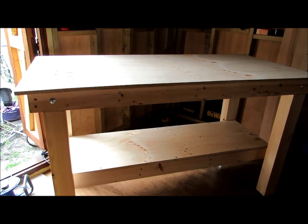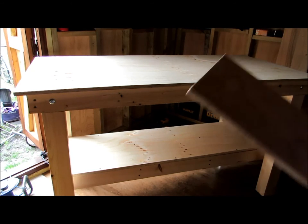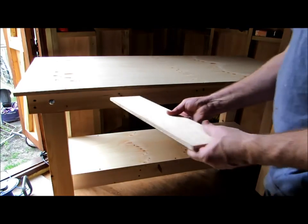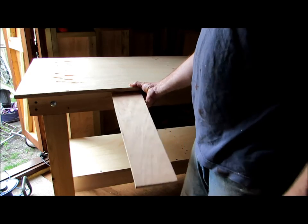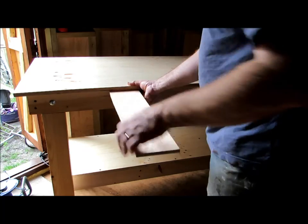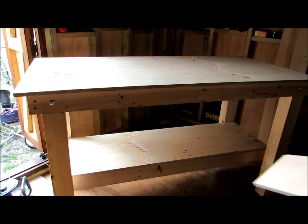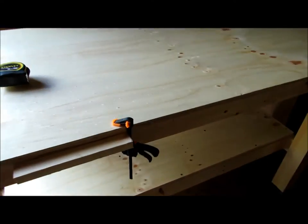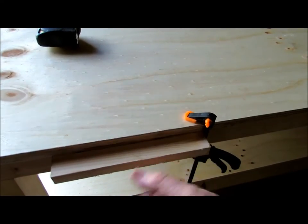So what I'm going to do is with an offcut of wood - I'll get a smaller one than this - measure four centimeters, stick it under there, clamp it. That's a trick from old Uncle Knackers of DIY for Knuckleheads. Clamp that there and I just do that and I know it's solid - square, in line. Got to do it more than one place, because otherwise it will go skew-whiff - lovely English word, you don't hear that very often these days.